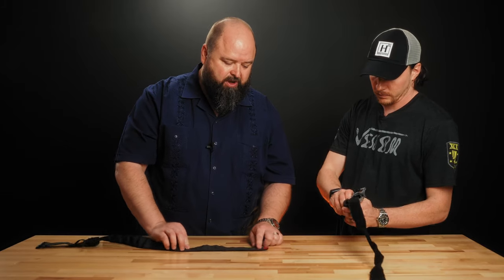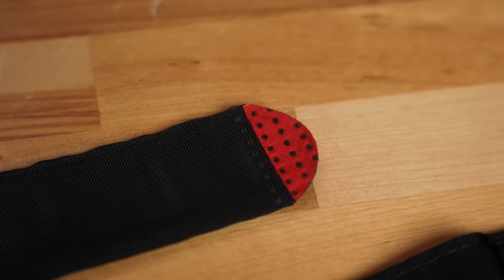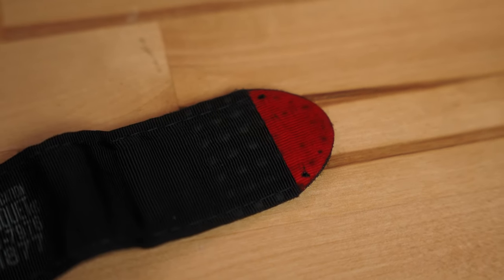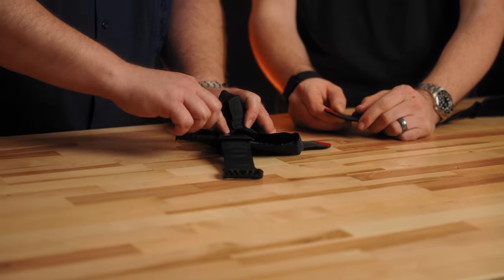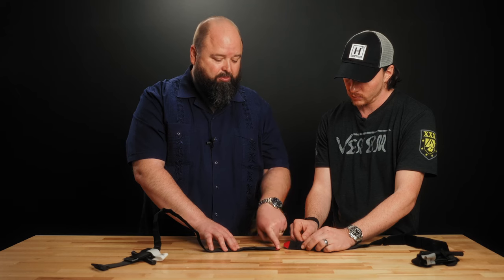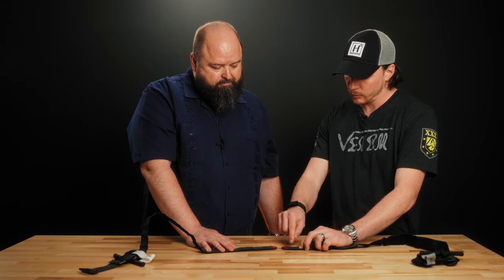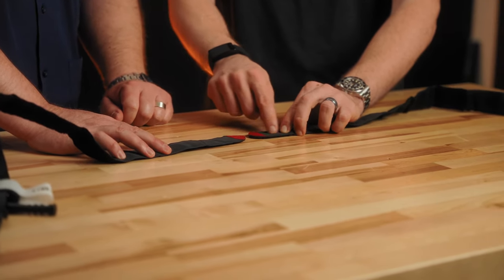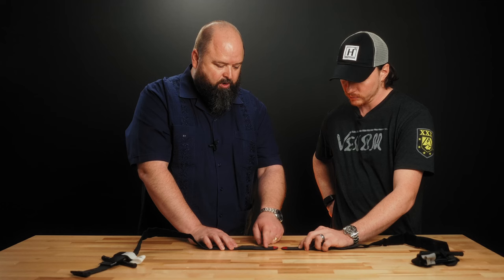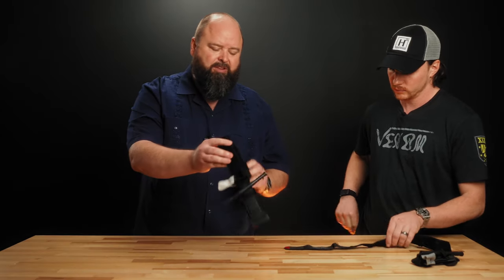If we even look at the red tip, you can see the glue dots are a little less prominent on the real one. It says 'CAT' stamped there. I've seen some fakes where they take the lot number and stamp it on with some kind of paint or ink. But on the fake, you can see how hard they pressed those dots — it probably deteriorated the material and the strength. It looks kind of welded or dotted. On the fake, the material stops right at the tip with no attachment, while the real one is secured further back. The real tip is more oval; the fake comes more to a point.